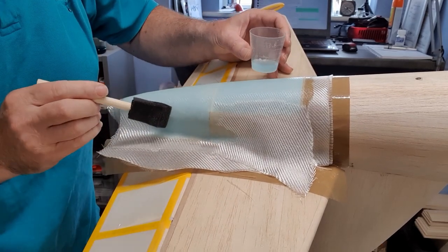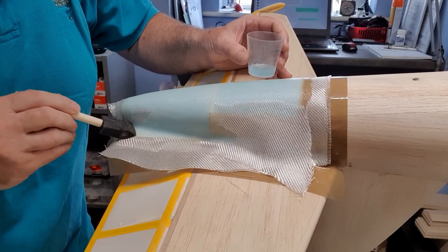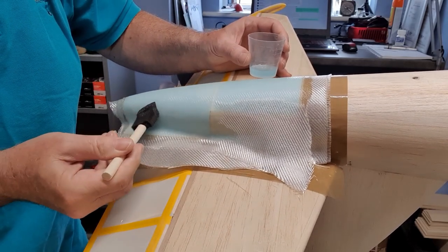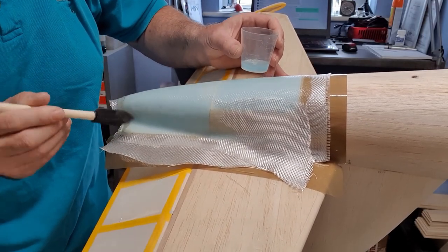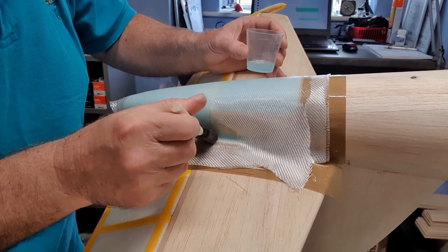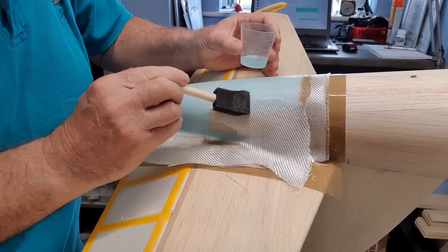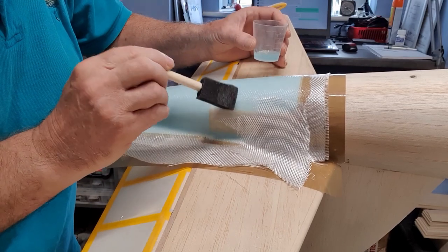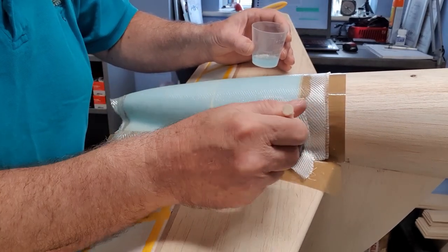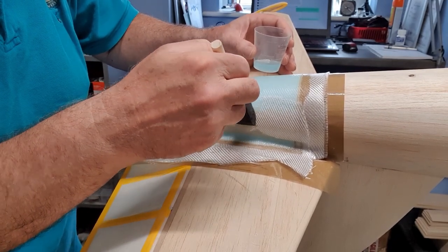These brushes are what's called Jenny brushes. Well, these are not real Jenny brushes. These are a clone of the original Jenny brush. It's basically a polyurethane foam that has a nylon stiffener down the middle, a piece of nylon plastic, to give it some rigidity, otherwise it would flex too much. And they work really well. They're especially good for varnishing and lacquering, because there's no way you can shed a bristle. But what you do have to watch is if you're using a solvent-based paint, and it's a pretty powerful solvent, such as a cellulose, it'll actually melt the foam, and you won't get bristles, you'll get bits of foam in your job. So worth noting, just be careful with the solvent that's in your paint.